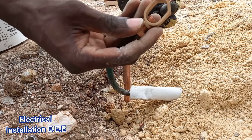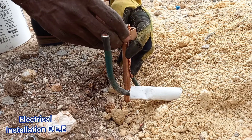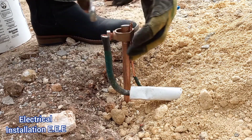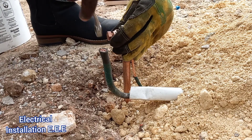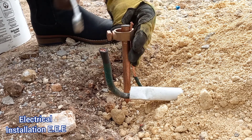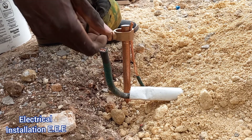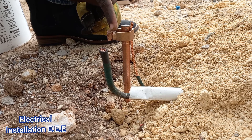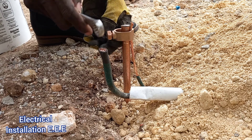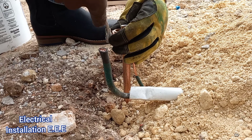Here we have the earth clamp. If we're going to earth the 10 millimeter wire and just bring it straight through and tighten it — it does get tight, but the reason we bend it is because we don't want it going all the way down like this. I can feel it would actually break off, and we don't want that. We want it to get as tight as possible. The purpose of bending it is to get more body into it.